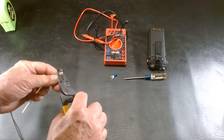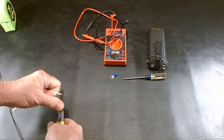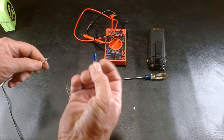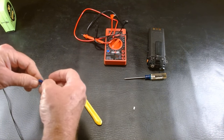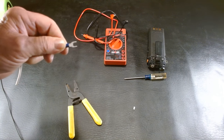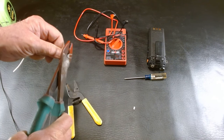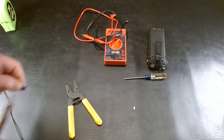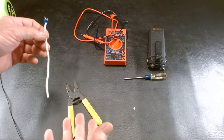Clip it — that's going to be our counterpoise right there, very simple, very inexpensive. Take the wire strippers and strip off about a quarter inch here. Get a good connection on that copper. Take our connector, slide it right over that sleeve until you see the copper come out the very end. Then take our crimping tool and crimp it up there. You could also solder this if you wanted to, to make an even better connection. But that's it — that's how you make it.